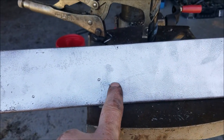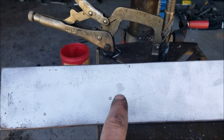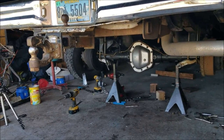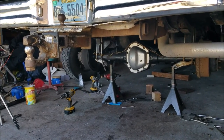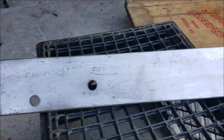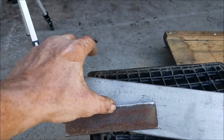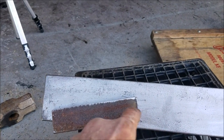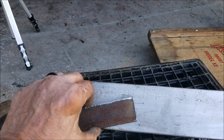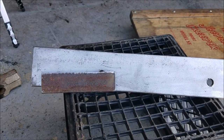You can see my print holes — I just touched with my 3/8-inch bit in those 3/8 holes. Now I'm going to do pilot holes and then bore to 9/16-inch holes, and on the truck I'm going to bore them out to 9/16 to accommodate these big bolts. Before I go bolt this back in I still have to bore the holes out there, but I'm going to weld this right here — just tack it here and there — then re-drill those holes because I need to shim it out for the frame. Then paint it black and install it.